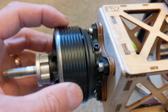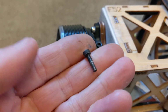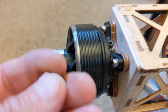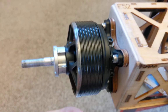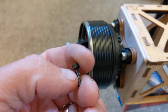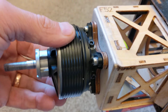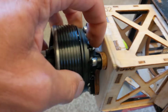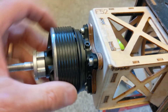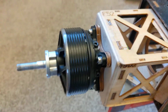It's a 25cc motor. You wouldn't put four little tiny 3mm screws on a 25cc petrol engine, even though it is electric and it don't vibrate. It's just crazy. They're gonna fatigue fail, and that's what's happening. And it may be fatigue failing because of that play. If that play were less, they might not get as much vibration when you do certain manoeuvres, and that might be why they're snapping off. So cure the play with a tube, cure them with 4mm, job done.